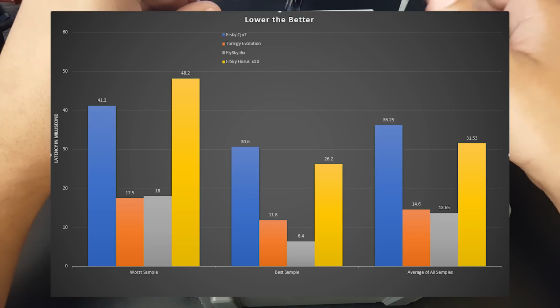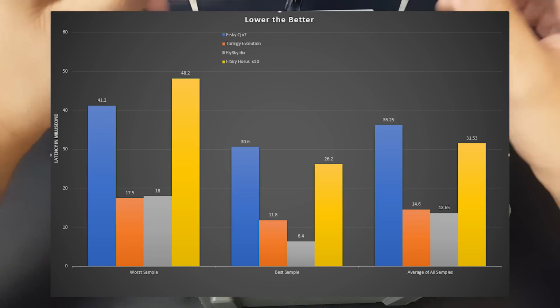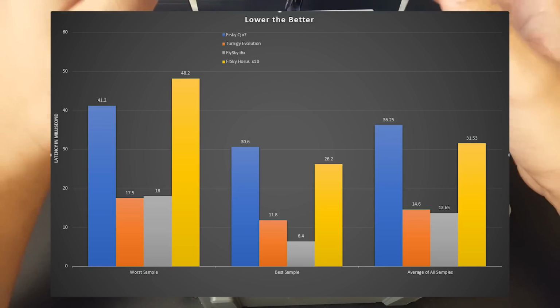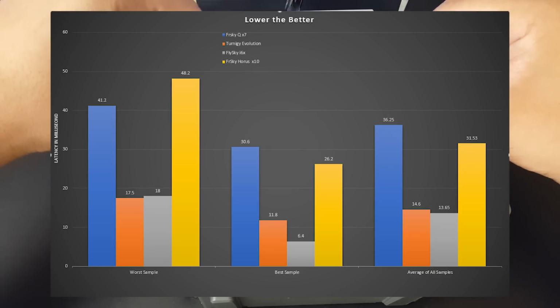And why is it good to see? Because that means there's room for improvement, and the problem is with the code, and the code needs to be modified and edited. Now, I did see some settings on the Horus which allows you to choose between the gimbals, which would be ADC and PWM. Now, I know these are not PWM gimbals, but the ADC, analog digital converter, I think that's where our issues are.